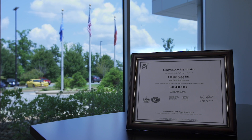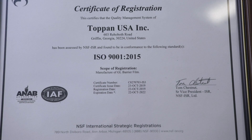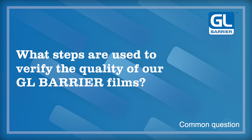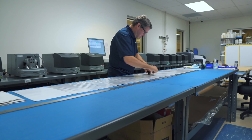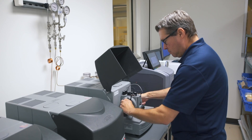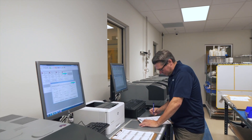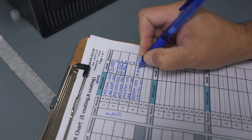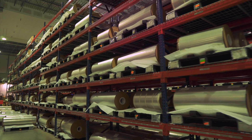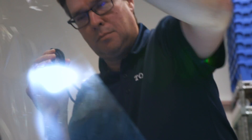Topan USA is ISO 9001:2015 certified. All of our quality standards, testing, and documentation are compliant with our current certification. We measure barrier performance, which includes oxygen and moisture transmission rates, by using Mocon inspection machines for every production lot we ship. For those grades suitable for use in retort packaging, our process also includes retort testing at 121 degrees Celsius for 30 minutes, which is typical for retort conditions. No film is released for shipment to our customers before being thoroughly tested and approved, as they must fall within our stated specifications.